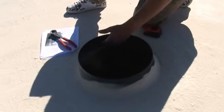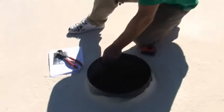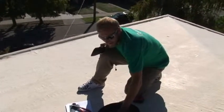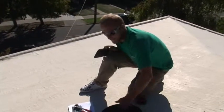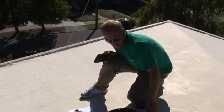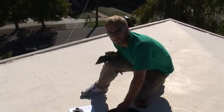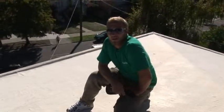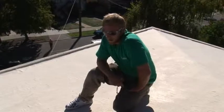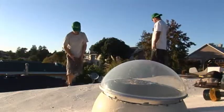Just in case the opening isn't large enough, I left it here because I'd rather not tear into the roofing material — I'd rather keep it waterproofed. But if I cannot get the full length of 2x6 in there, then I will have to pull out the base and cut it from one rafter to the next, so that way we can re-deck it and it'll be nice and solid for the re-roof. The 2x6 lengths are anywhere from 7 to 10 feet.